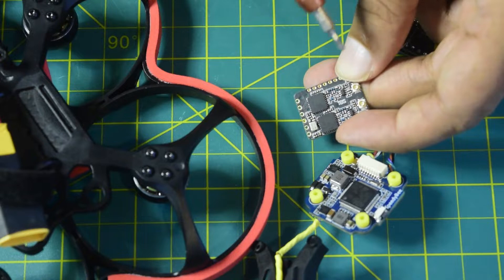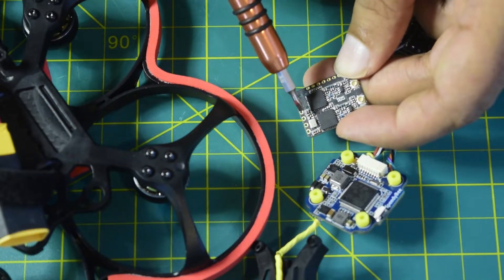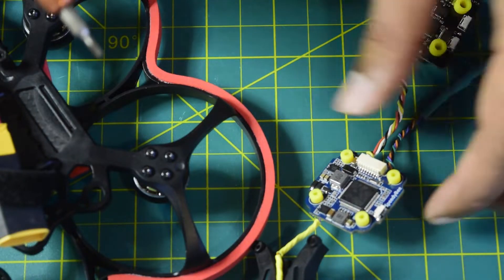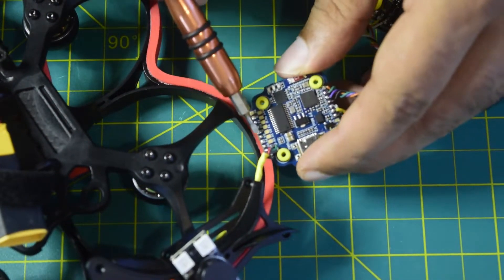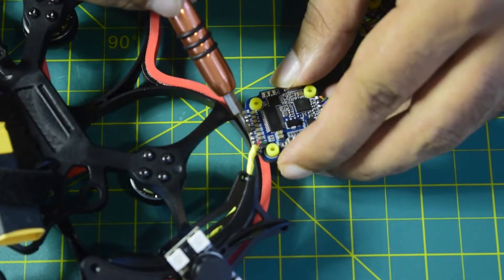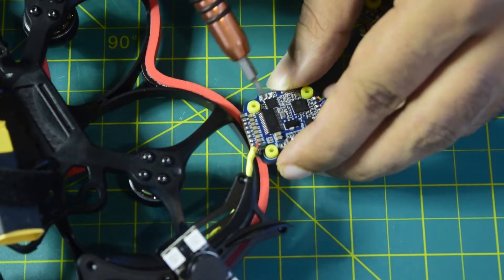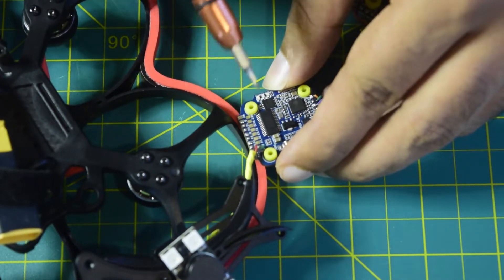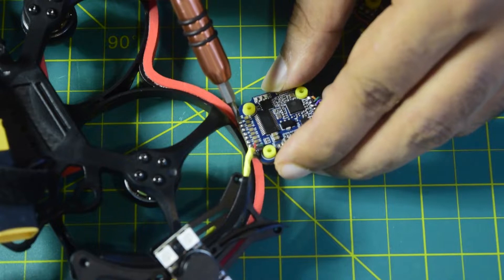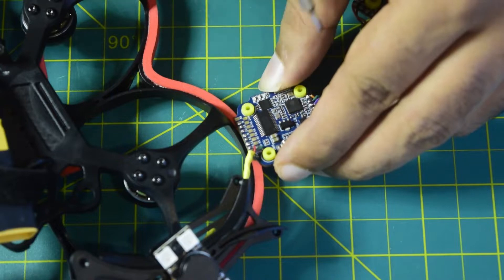So that is how I'm going to connect it. Let's tin the pads and solder them to connect onto the flight controller. First let's look at the flight controller as well. On this PDB F7 mini flight controller, I have 5V, T1, and R1 for the main control pins, plus ground. Then T2 and R2 are available as a free UART which I'm going to use for Mavlink.